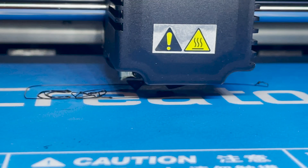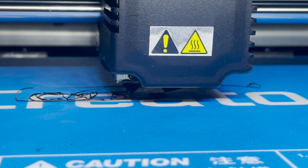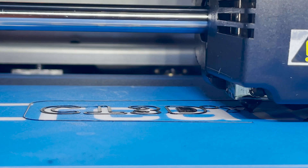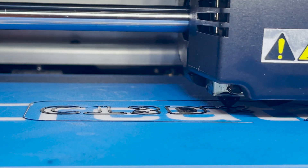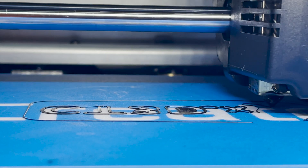If it's too high, it looks like this — it's either going to barely touch, or like you can see here, it might not even stick at all. You'll notice this right away when you do any rounded area or bends in the print. This is exactly what it should look like: it's sticking on there just enough, but it still has its own shape. If I touch it, it stays in place because it's actually just the right adhesion to the bed.